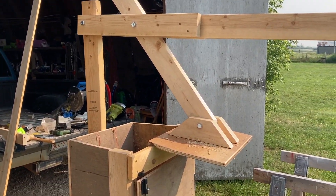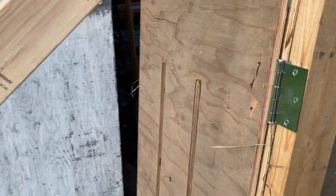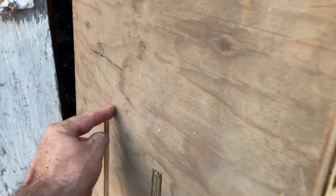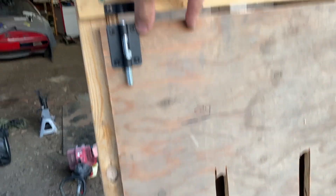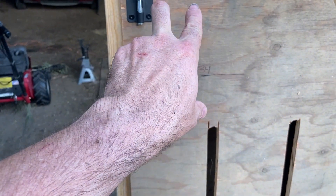That's how you build the baler box — whether it works or not yet to be proven. Back at the Quonset, we're six bales in and things are running great. A few updates and mods: here's our 34-inch line, and my hole doesn't make it that far, so we have to cram the string down into the hay. Mod one: extend the slot up to and beyond 34 inches so we can just take the string and pull it through. Mod two: put a piece of wood — maybe a two by four or two by two — on the door because it bows out since the latch points are so far apart.